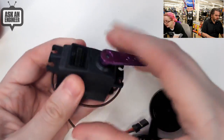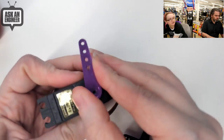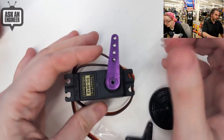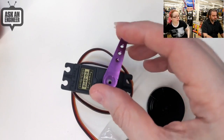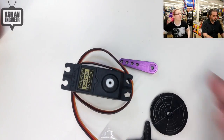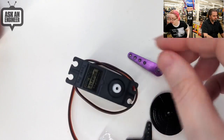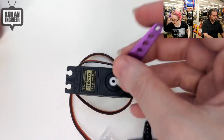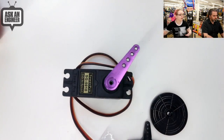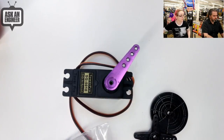25 to 30 millimeters. It has 25 teeth. It's machined aluminum. It's incredibly strong, but very light. And it's got four tapped holes, 5 millimeters apart. They're M2 screw holes, so it works great with our standard size servos. It won't work with a micro servo or a mini servo. But if you've got these standard chunky servos, the Metal Gear ones, or the standard SG5010s, add it on, use the screw that comes with your servo to attach it. Boom, you've got a nice servo arm.